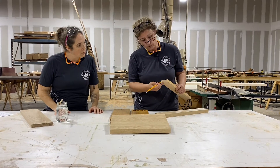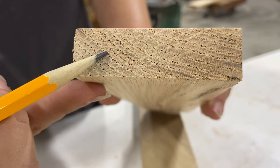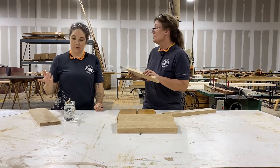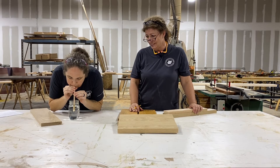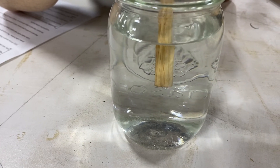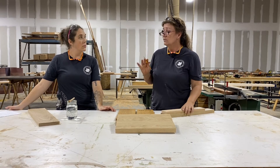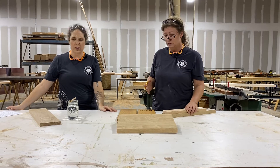When you look at the end of a red oak board, you're going to see there are actually holes — very tiny and hard to see, but on a freshly cut end you can see them. Red oak is actually very reedy. If you take a dowel, you can blow air all the way through it to create bubbles. That's what happens with red oak — air passes through it, and that also means it will suck in moisture, water, and stain. Red oak is notorious for that, which makes it a less beneficial wood to use in wet environments. It's not good for cutting boards.